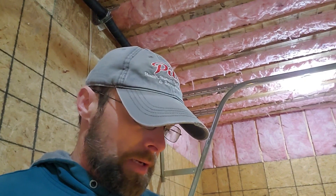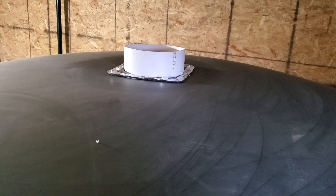I've got to pressurize the whole system to make sure I don't have any leaks before we do drywall. I've got a 10% off coupon at Tractor Supply where I'm going to buy the pump, and that expires in a couple days, so I really need to buckle down and get this water system going. I tapped into the top with the inlet pipe — you can see it goes down just a couple inches above the bottom. The reason is I didn't want this big splashing sound when water comes in. If I just had it dump into the top, it would be dropping several feet and would be really loud.